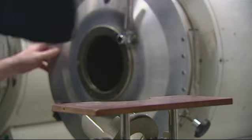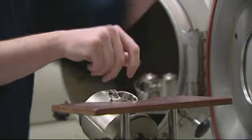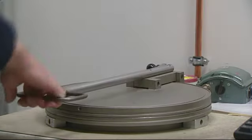In order to permanently protect the strain gauges from moisture, the interior of the load cells is first completely evacuated and then filled with a gas mix. The load cells then undergo a special test process to check their leak tightness, and thus meet the criteria for the highest IP rating on the market.